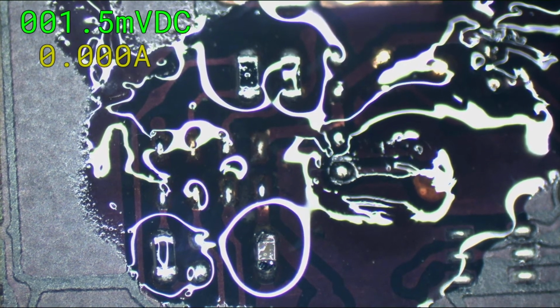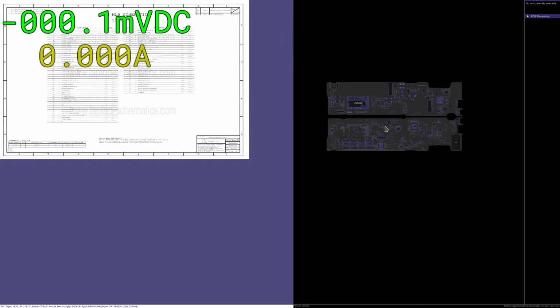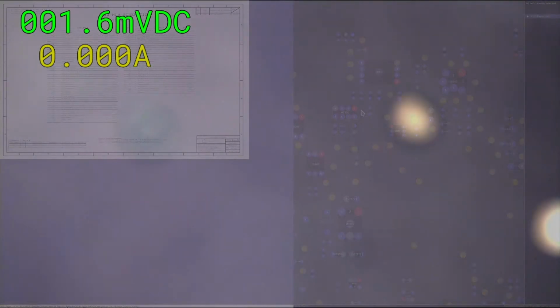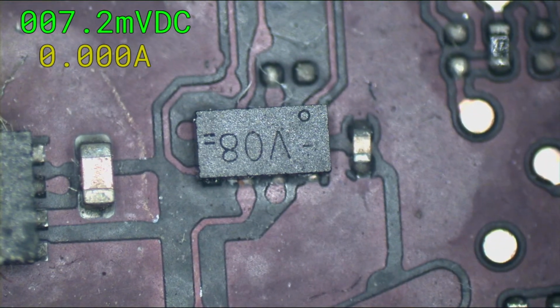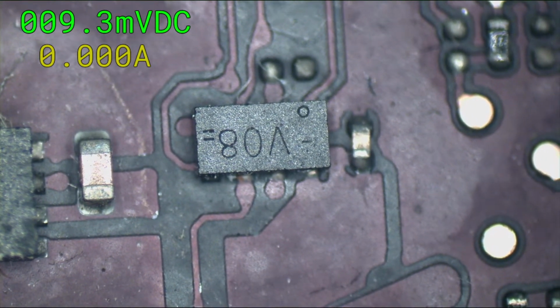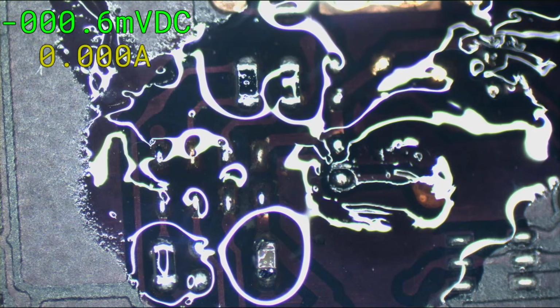Make sure of my orientation. Oh, this trackpad. A trackball. Where are we? We're right here. So the red one's pin 1, and on the board, pin 1 is that little circle. That's your marking for pin 1 usually, a little dot or a little circle, something round most of the time. So I have the board in the orientation I'm taking it off in, putting it right back down, make it easy on myself.